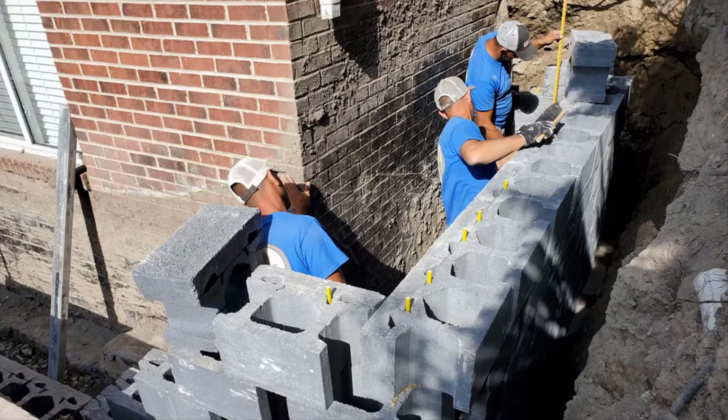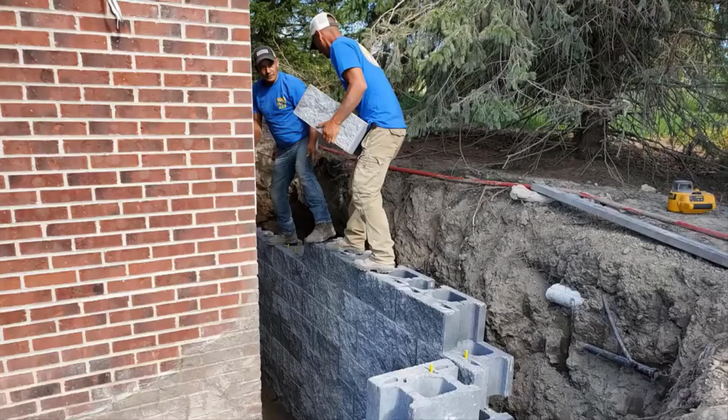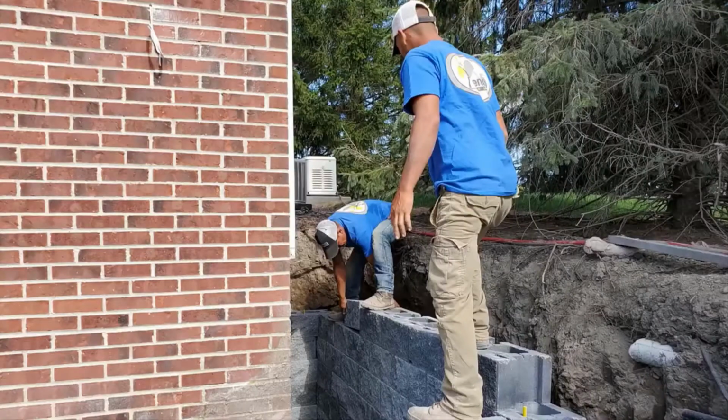And that's that. So here are those 86-pound blocks. You can see the fiberglass pins. This is some serious stuff. When I say they make bridges out of this, I'm not kidding you. This is the only block Scott and I will use. You can see the guys have been slinging these 86-pound blocks, putting the fiberglass pins that tie them together in the block, and they're going to fill all those voids. Every single one of these blocks gets filled with drainage stone, and behind them as well.